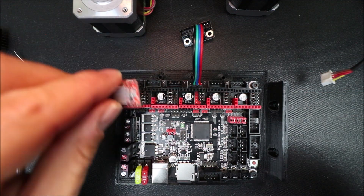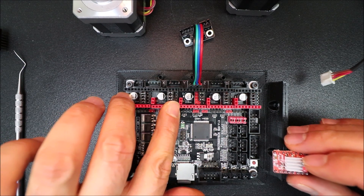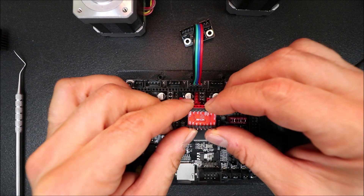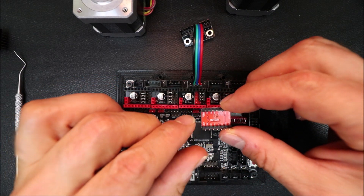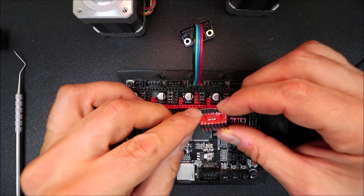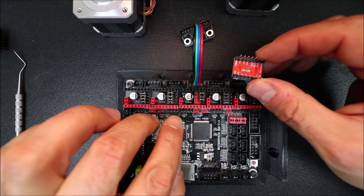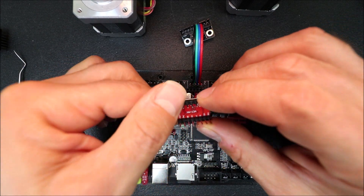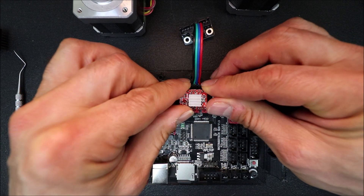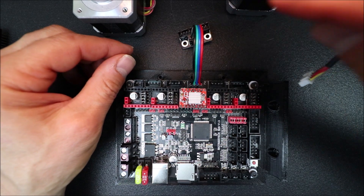To place this on, we know the enable pin is here based on my previous tutorials for the A4988 and the DRV8825, which I go into in extreme detail. All we care about right now is the enable pin on the A4988 so we can orient it correctly. We're going to place the pins over here and push it down — that's how we have that set up.